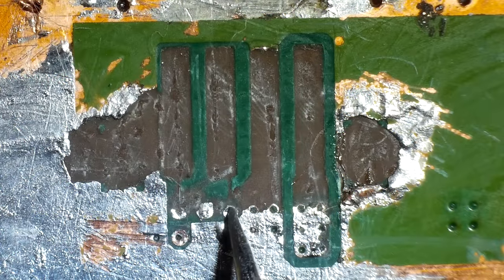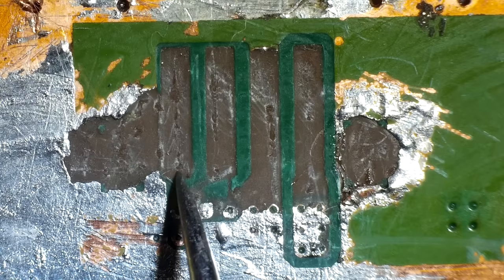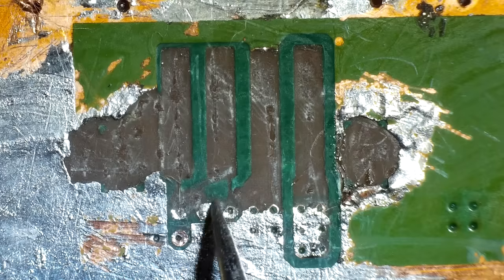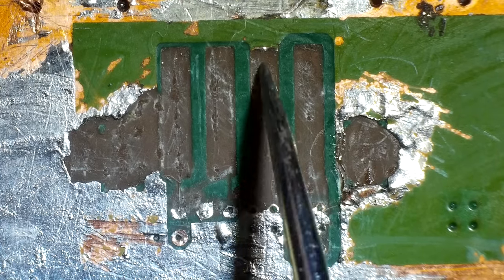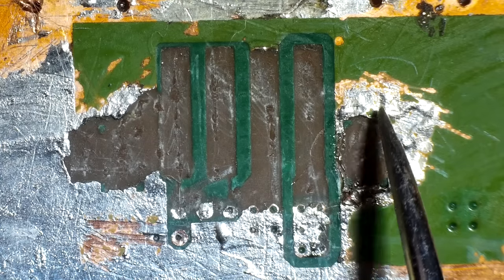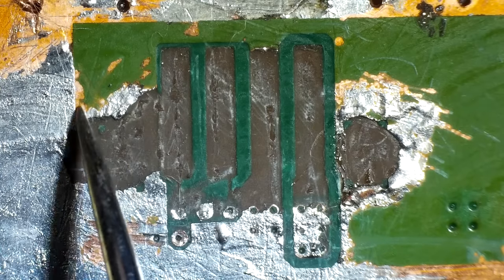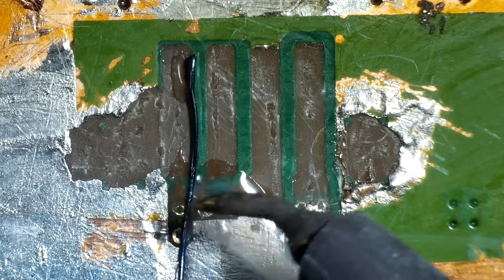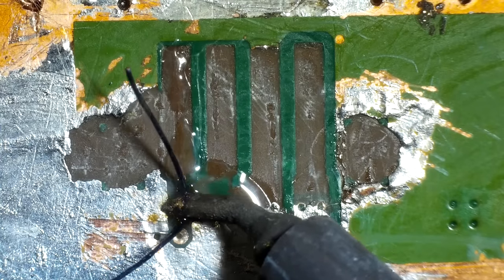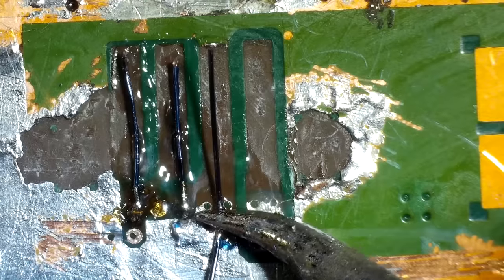I can barely see what's left of these pins on the board. This little via right here needs to connect to this connector, this via right here needs to connect to this trace on the board, then we'll run another wire from here up and another from here to here. After that we'll try and repair the mounting pins — I'm going to put a thin piece of copper down in here and attach it to what's left of the board, same thing on the other side, to give us something to mount the connector down to. I'll be using some tiny enameled wire to run these traces, and in order to connect the wire to the pin on the connector I will need to burn off the enamel and then solder it directly.